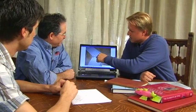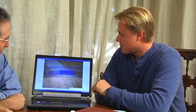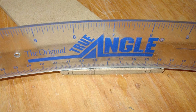Cool. Very good. So, how did you figure out what the radius was going to be for that miter? Well, first I just looked at these 2 points and where they would actually intersect. And I started just freehand drawing an approximate curve. But in order to get a nice fair curve, I just used a flexible protractor, and that'll give you a pretty nice radius. Great idea. It was enough for these purposes. So it's a fair curve. It's a fair radius. He could see that he had to pull this particular profile line back to that certain point, and then once you have that third point, it's easy to get a fair radius. Aha. Very cool.